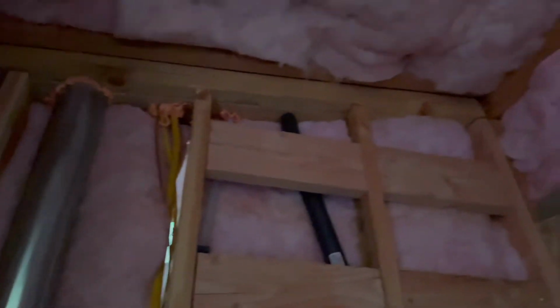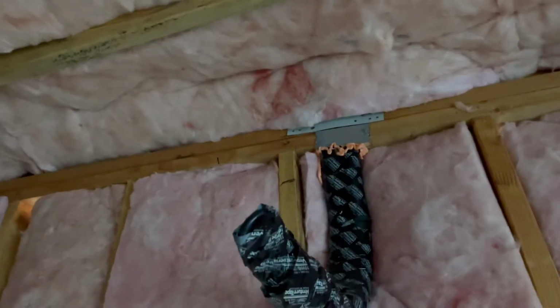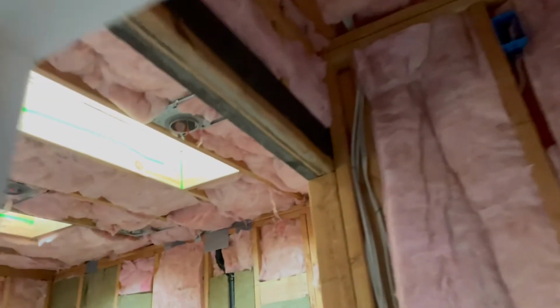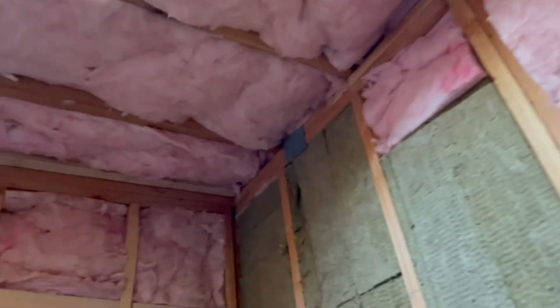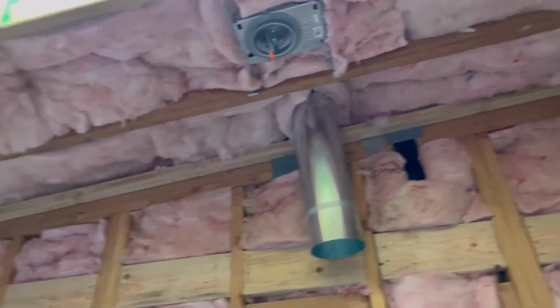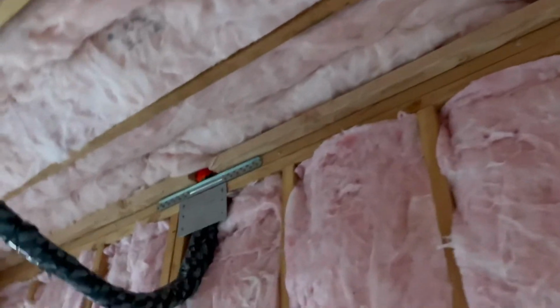Yeah, the last thing to keep in mind, that you want to fill all of your penetrations. You need to foam them as well. So your electrical penetrations, around your line sets, your vents, your water lines. You can't really see them now, but just make sure that you walk all the way around and get all those penetrations filled with foam.